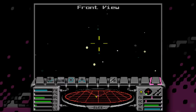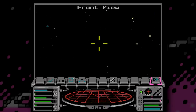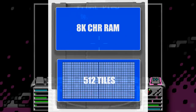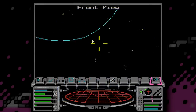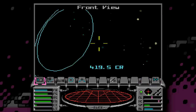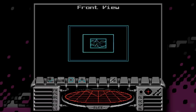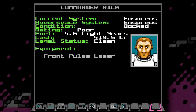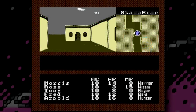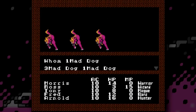Why? Well, you can't construct the 3D graphics in this game with ready-made tiles — 512 graphics tiles is nowhere near enough to draw every possible angle and every possible configuration of lines in a game like this. The solution: replace the Character ROM with Character RAM. Instead of predefined tiles stored in ROM, Elite on the NES has an extra 8KB of rewritable RAM in the cartridge, making the NES much more like other systems. The NES doesn't have to rely on predefined shapes — it can effectively draw its own tiles as it needs them and create any arbitrary shapes required. The Bard's Tale uses the exact same setup, as did quite a few others.